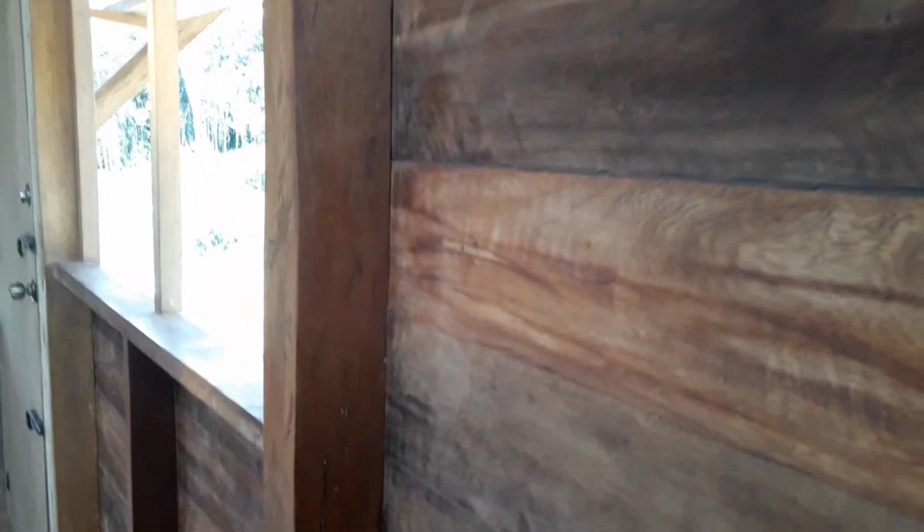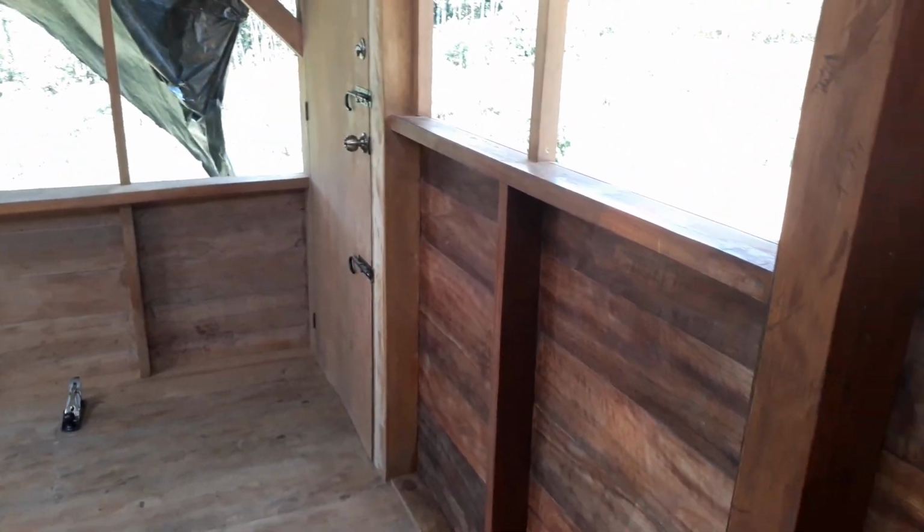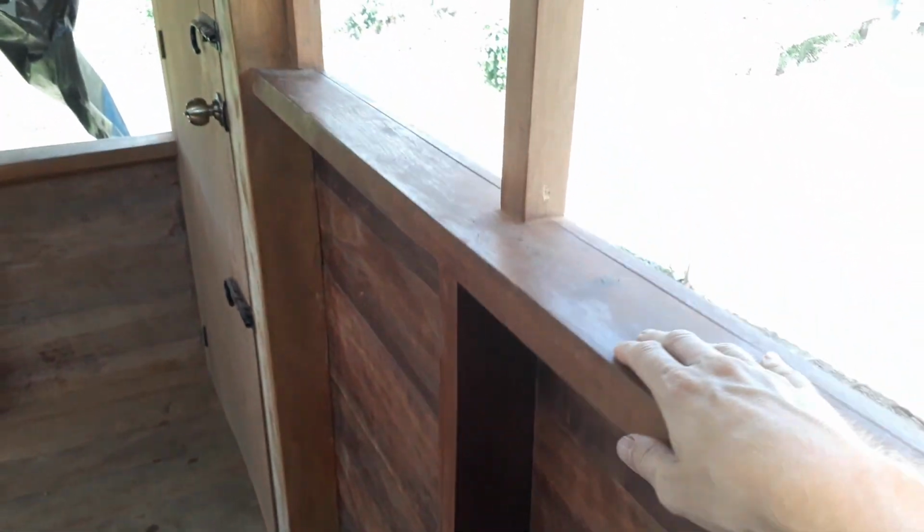Anyway, so we painted the linseed oil, and some people using linseed oil in the humid tropics have negative experiences because it doesn't dry properly. It gets sticky, and sometimes grows little dots of black mildew. There's none here, I'm just showing you. It would be like little speckled dots all over it. For example, if it were to happen here, which it didn't, not yet at least. Anyways, we've had some trial and error situations, and basically what we found the best thing to do, right?